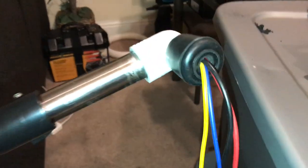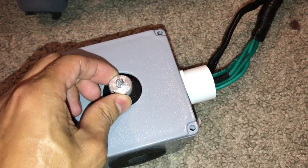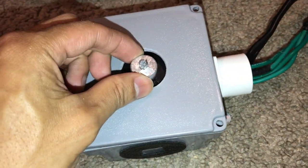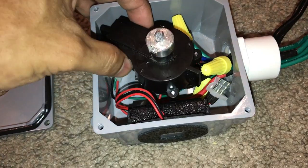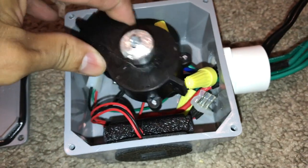The second thing that I did was cut all the wires and replace each of them with a seven foot extension. Each wire requires two connectors. Once I got all the wires connected, it was just a matter of removing the actual switch from the trolling motor and cutting off the handle. I just had to situate everything and kind of play around with the junction box and lay everything out so everything fits nice and snug, but it doesn't touch or rub too much.